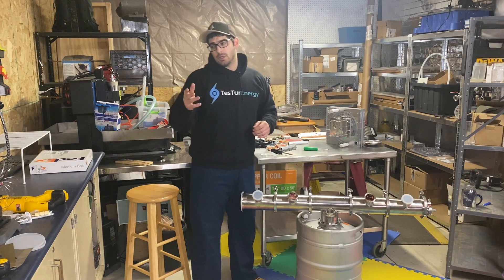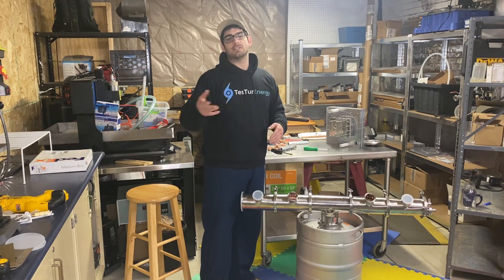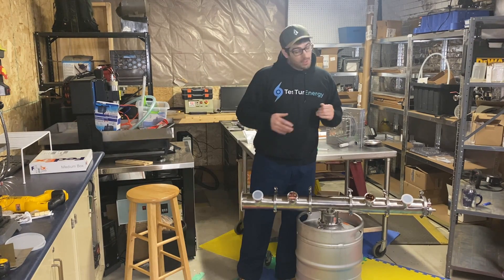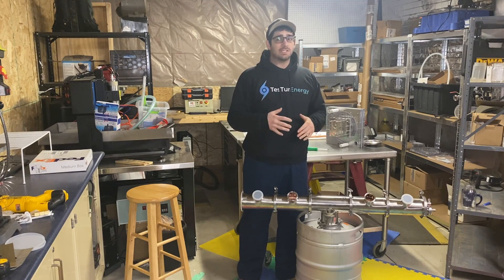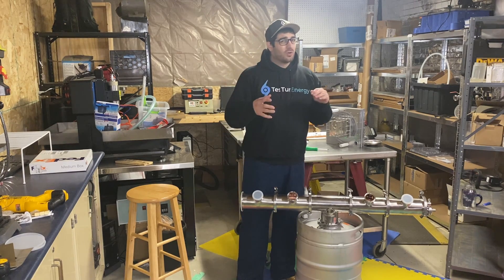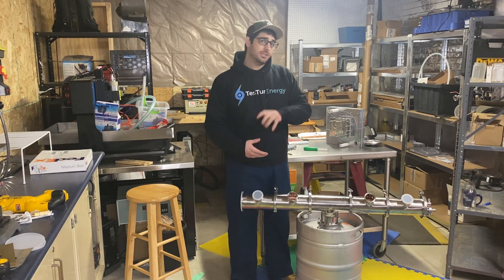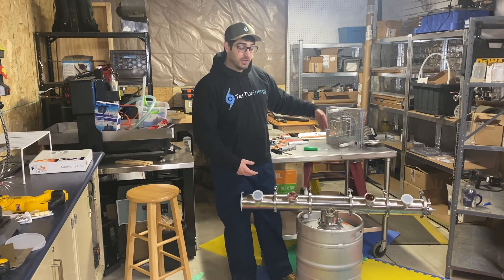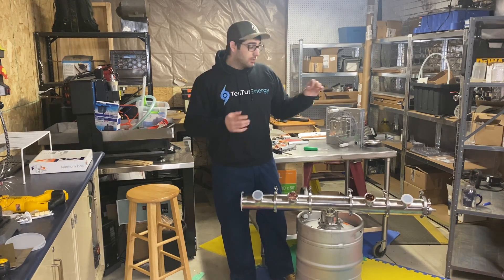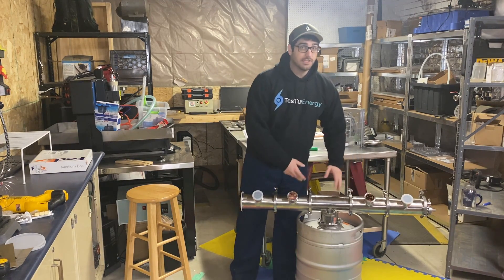Check out that article — there are a couple of other lesser-known but information-dense Tesla articles linked in the description I highly recommend. One thing many people might not realize is that this system can achieve near whole-system efficiencies of 75 to 90 percent. Regardless of how effective the turbine is at converting heat to electrical energy, the exhaust from the turbine goes to the condenser, and the leftover heat must be extracted to maintain the vacuum. That heat from the shell-and-tube heat exchanger needs to go somewhere.